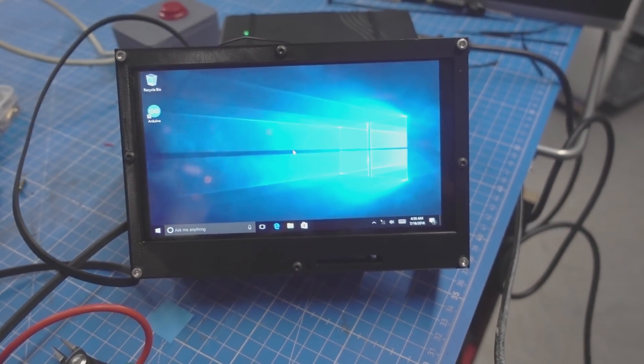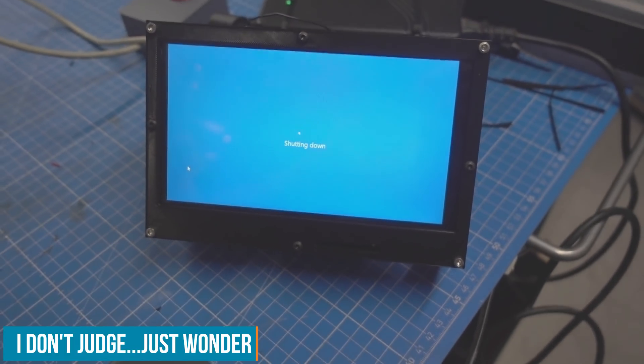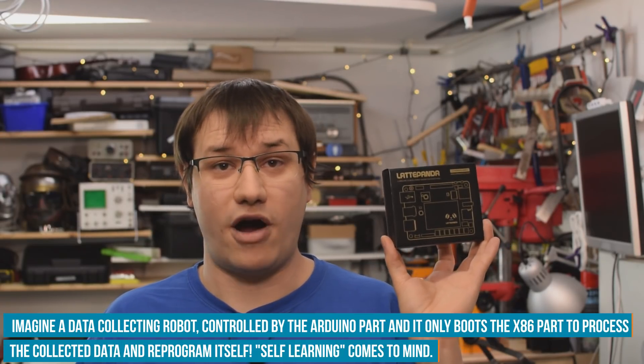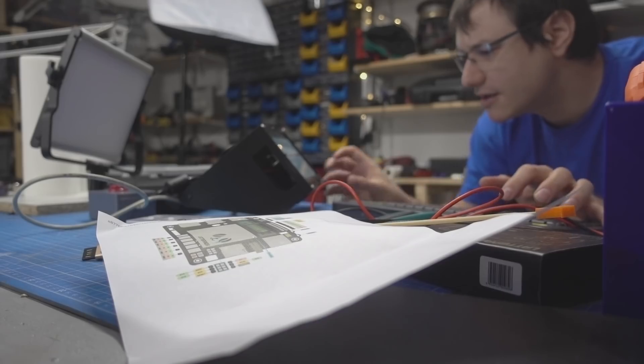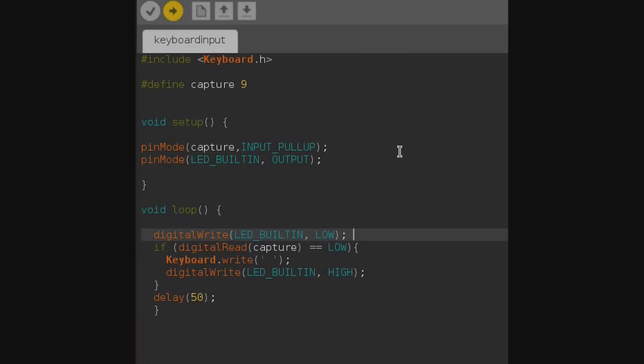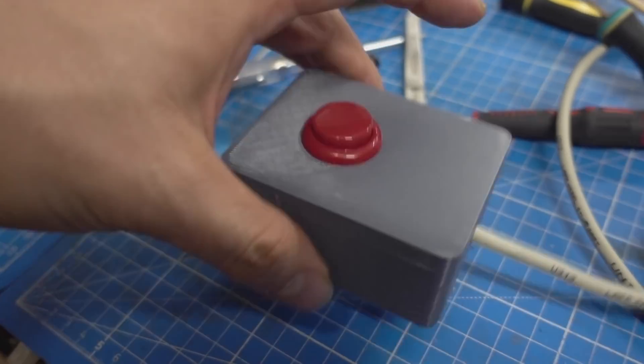Latte Panda is compatible with a lot of programs from the desktop world — you can even run full Windows 10 on it. But the main advantage is that it has an on-board Arduino Leonardo built right into the board, which I can use for the real-time part of the software, while the x86 processor handles all the higher-level operating system tasks. They can even run independently of each other, so I could use the real-time part without even booting the single board computer. For this project, the Latte Panda is my single board computer of choice. It's easy to write an Arduino sketch that reads a button press and sends a keyboard command to the OS over USB, and the Latte Panda already has the Arduino built in, so I don't need anything extra.